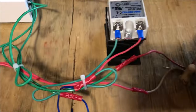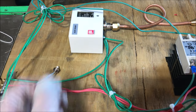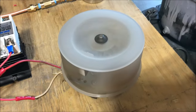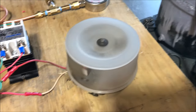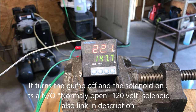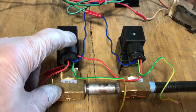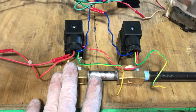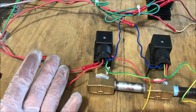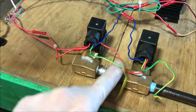Basically, when you let your hand off the trigger of the gun, the pressure spike causes the pressure switch to shut off this propane valve and to shut off the water pump — which is being mimicked by this fan here. When the temperature you've set is exceeded, this solenoid is shut off, but the gas isn't completely shut off. This particular setup will be connected to a calibrated bypass needle valve that we'll set to a determined rate — say, 10% of the burner capacity.